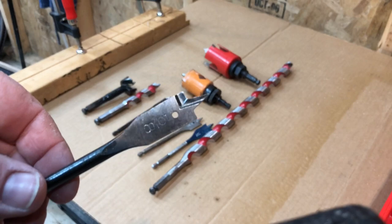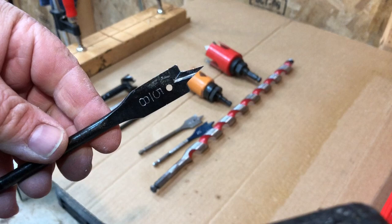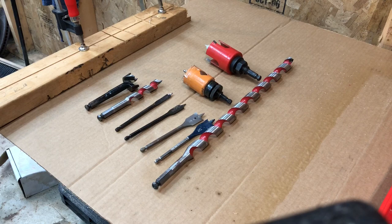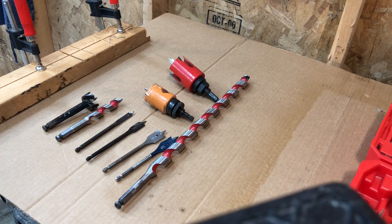The ones I prefer are the DeWalts. These seem to last a really long time. They don't have those points — just a flat cutting edge — and they do a real nice job. It's all about speeds and feeds. A colleague told me today that an old machinist told him: the larger the cutting area, the slower you have to go when drilling.